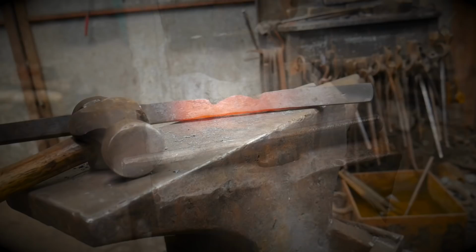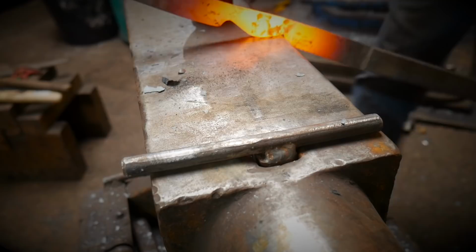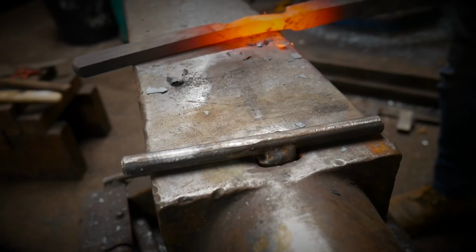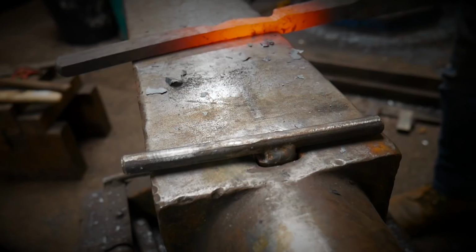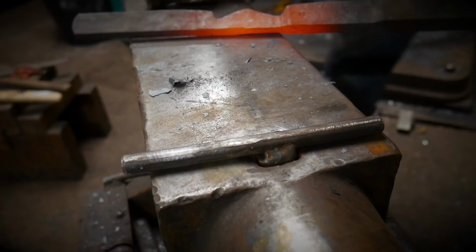And same again, just a little bit more of a close up. I'm going to come to the far side of the anvil. I'm going to set that material into a triangle on the near side, my side. Flatten everything out. So that you have a triangle in the center. Okay, then we're gonna turn the triangle up on end.